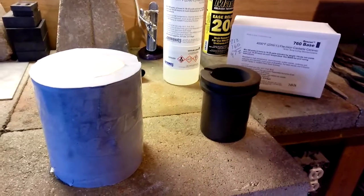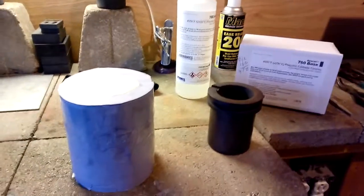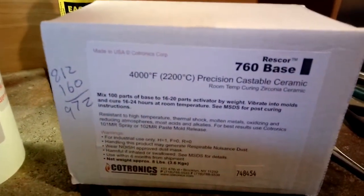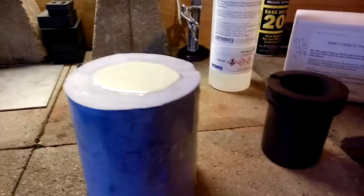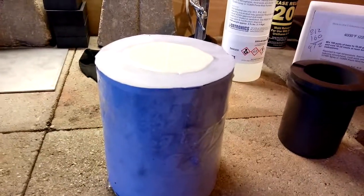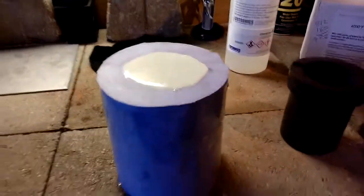So I did some research and got online, started looking around. From what I've found, the best pourable ceramic mix is this stuff right here — it's rated to 4,000 degrees. I made a rubber mold out of this crucible right here, cut it open, got it back together, and poured in the ceramic mix just a little bit ago. When it's all mixed up it looks kind of like runny cement.